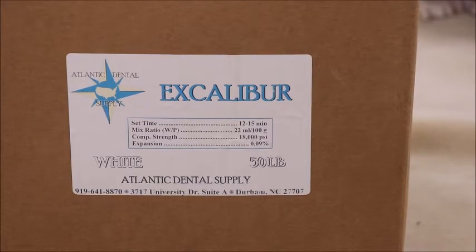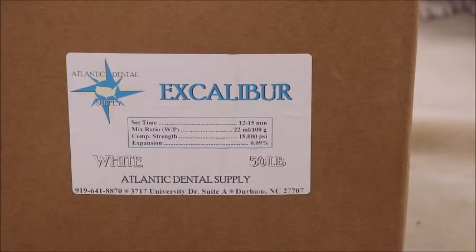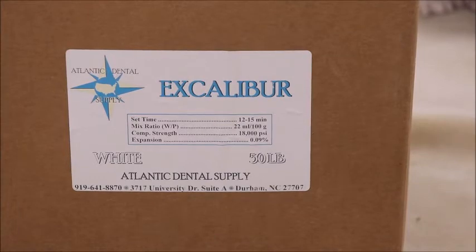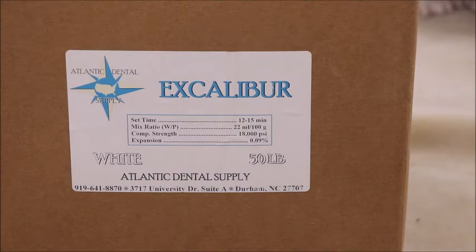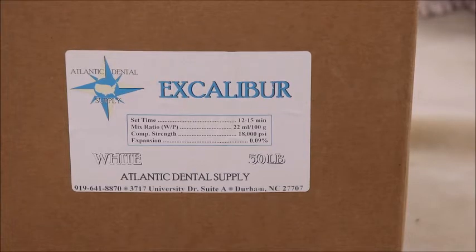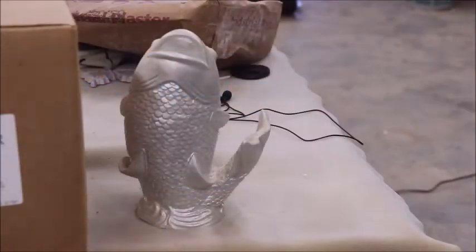It's denser, it's not as absorbent, it does not make as good a mold as the regular industrial plaster, but it does make an excellent 3D casting, especially a casting where you have to pull the latex mold off of the molding when it hardens. Let me get a piece and show you what it looks like.